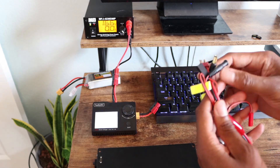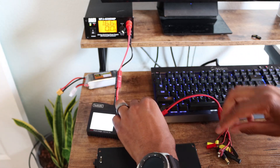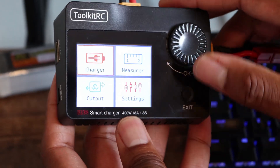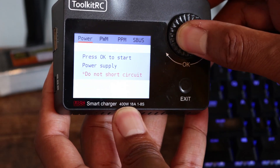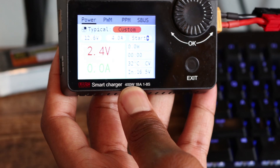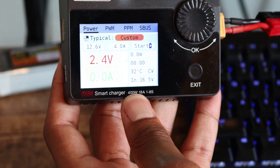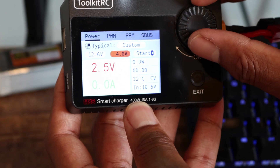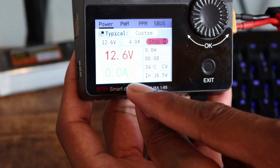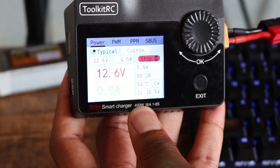To the output I'm going to hook up the center pin positive connector. But before I do that, let me zoom in and show you the settings. I'm going to go to output power and I have it preset to 12.6 volts at 4 amps, since this is a 4,000 milliamp or 4 amp-hour battery pack, and that will give it enough power to charge. I'm going to go ahead and start that power output. You can see it's showing 12.6 volts and zero amps. We're going to monitor how many amps this is drawing, because that will allow you to see what state your battery is charged. I'll zoom back out and plug it in.